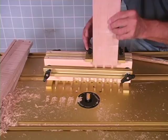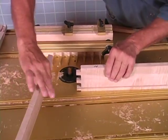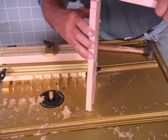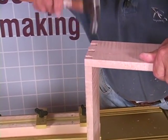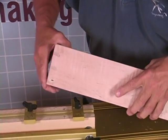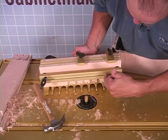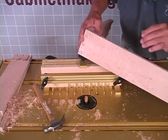Now we'll show you how this fits together. Here are the sides of our drawers. Here's number two and here's number two. The grooves have to go together, of course, and we're going to set it right like this. I like my dovetail to be fairly tight and snug. You can make this joint looser simply by taking this backer board right here — you can see I shimmed a little bit, I put a little piece of cardboard in here. I'll loosen the two set screws. If you want a looser joint, just shim this and bring that backer board out a little bit.